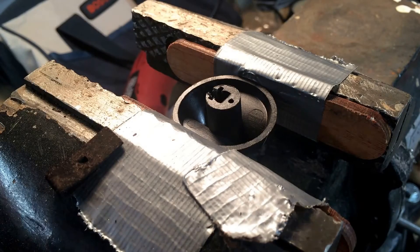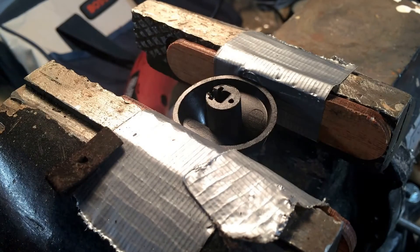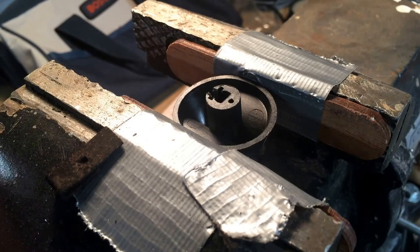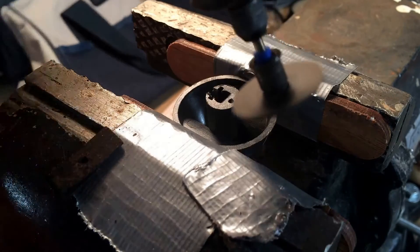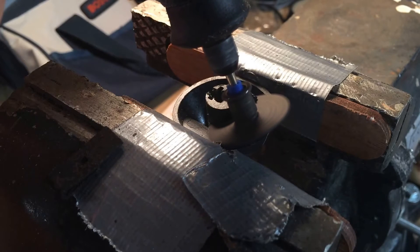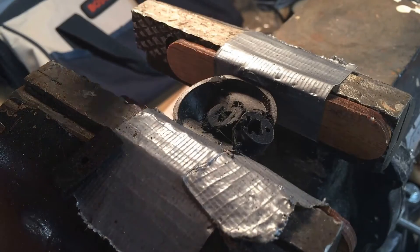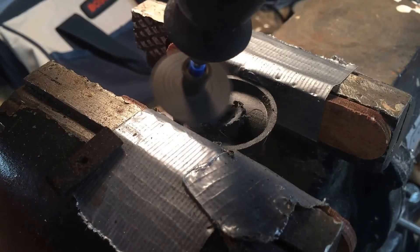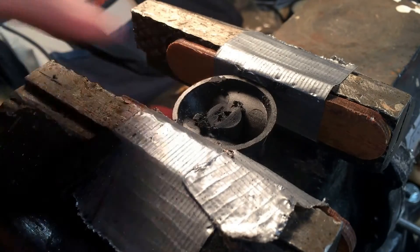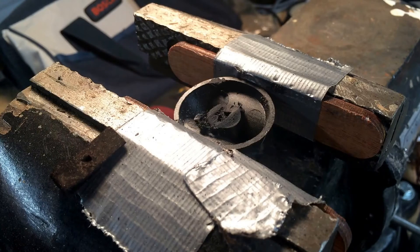I used a pair of needle nose pliers and I pulled out a piece of spring steel — this little tiny piece of steel that was inside the knob. I'm going to get that out of there before we use the Dremel tool. So I've got the Dremel tool with a cutoff wheel and safety glasses on, of course, and let's get to do some cutting. I just wanted to get the knob down to about level with the top of the bottom of the knob — get that center knob out of there because that's where we're going to put the Instamorph when we make our new adapter piece.